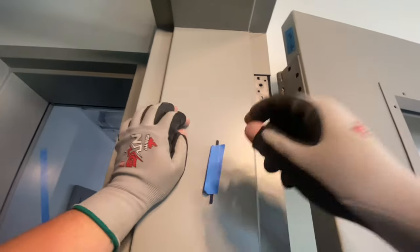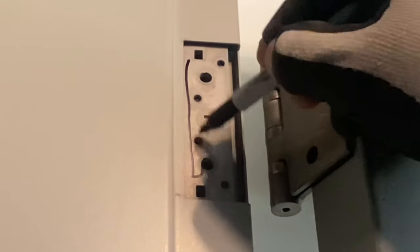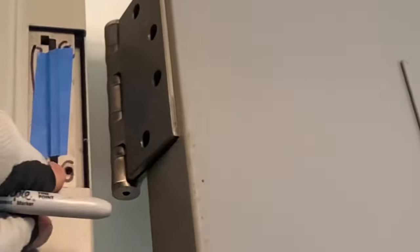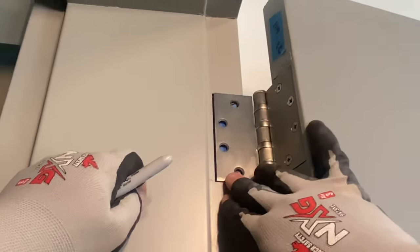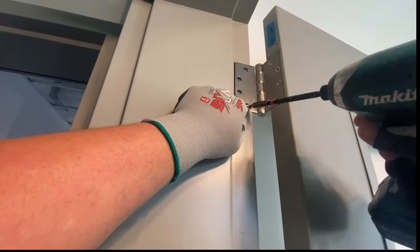I need this hinge to pivot back. In terms of shim placement, one option is to put it on the inner side of the hinge pocket — tightening the outer holes would pull it back. But in the method I'm using today, instead of shimming on the inside, I like placing the shim in the middle and running it the full length of the hinge. One reason I like that is it gives me the maximum adjustability and fine-tune ability, because with a half turn of a screw or tightening one screw or the other, I can really dial in exactly where it's going to land.